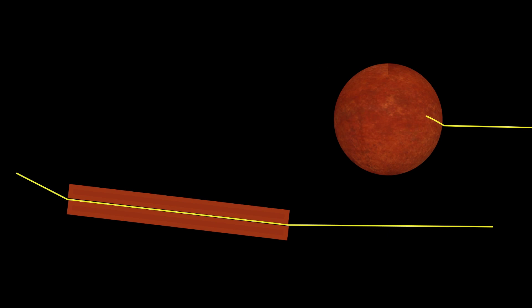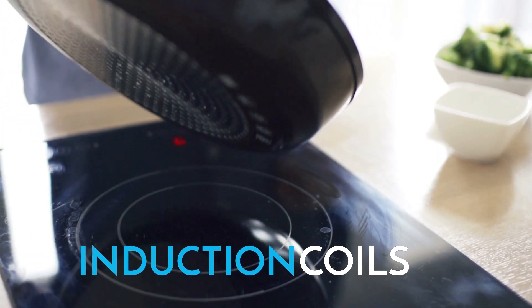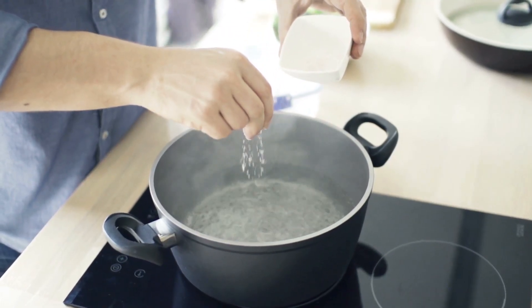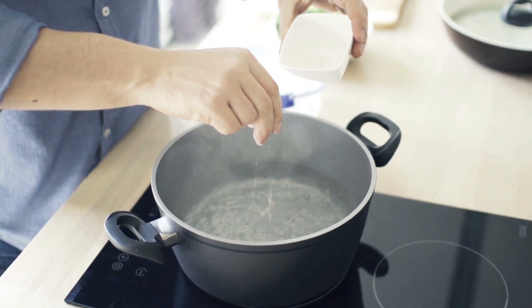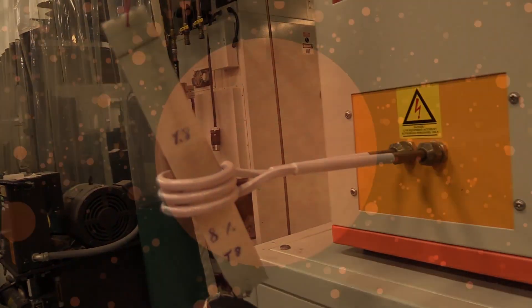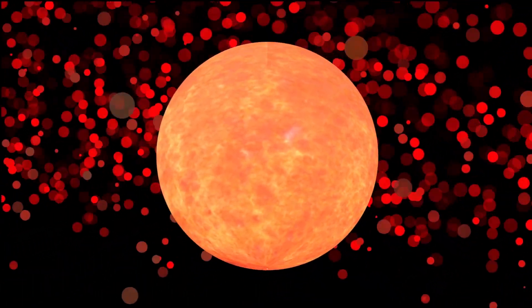Round spheres also make cracks hard to propagate — less chance for cracks in your glue is a good thing. The process works like this: you know induction coils in modern stoves — they rapidly heat up a pot or skillet, but not your hand if you graze it. Michigan State uses rapid induction, or magnetic heating like this, to heat the nano-sized iron dust balls in the plastic glue.